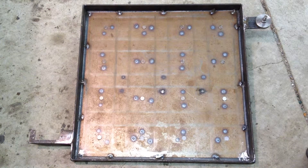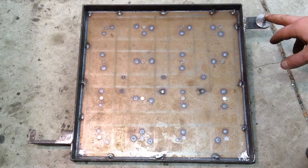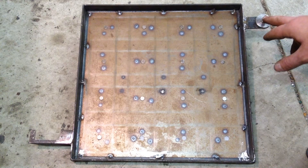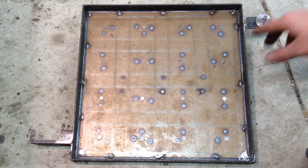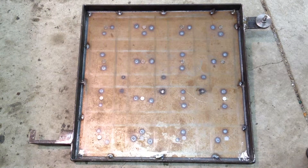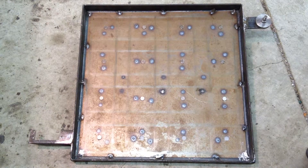The frame is tightened up so the blocks fit better, and I also had to change the position of the drive gear and the free spinning gear. Both of these were cut off, then the frame was cut apart, trimmed down, and welded back together. You can see this pattern throughout — those are welds I'll show you in a little bit on the back.